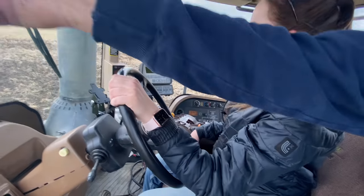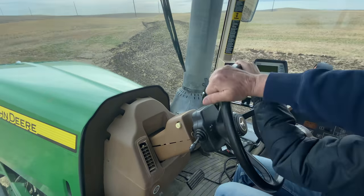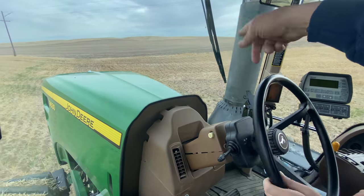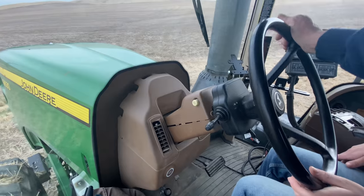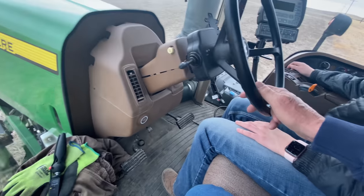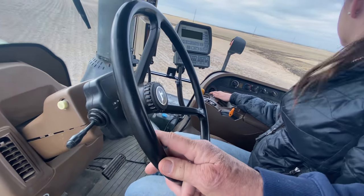You can see this is white up here — alkaline. So we're not going to be really deep, because it might be soft and wet. We don't know. When we get up here, we've got to go left with the coullie. We're going up here. I'll just kind of drive straight over there, and we're going to follow this up and lift up, then turn right. We've got to come back down that, because we went up. We're just going to plow a little. This is pretty damp looking. So we're not going to plow there. I'm going to tell you when to lift the plow. We just let it walk through here, because this is still damp — really damp. So we're going to go up here and teardrop back in on that a little bit.